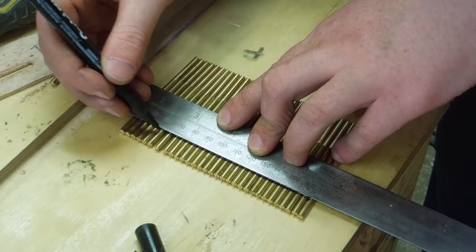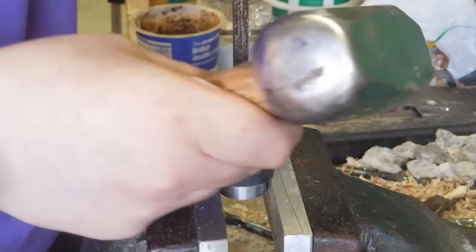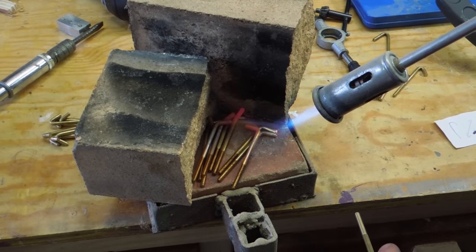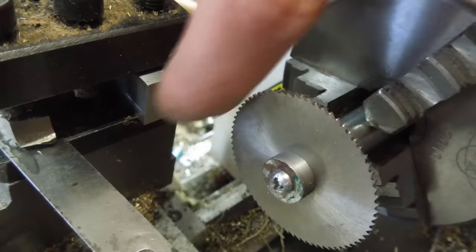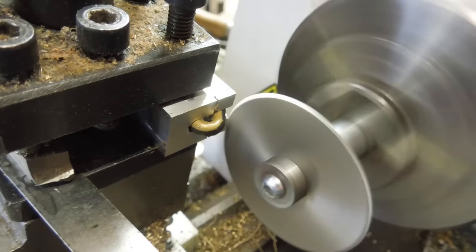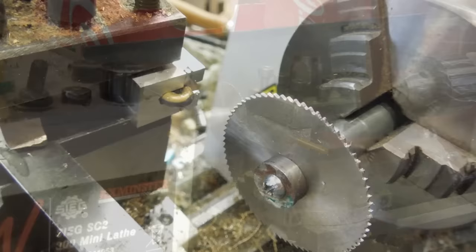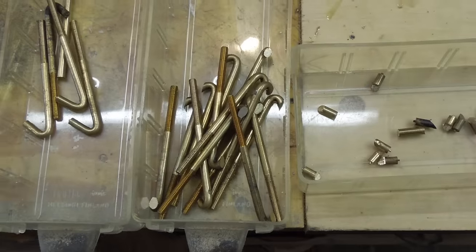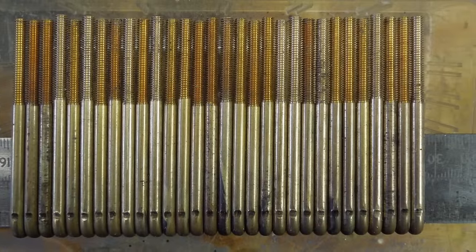They are all marked and then bent. Brass, especially CZ121, tends to work-harden and get brittle. To get around this they are annealed part way through the bending — heating the brass until it barely glows and then letting it cool. An aluminium fixture, just a block with a hole drilled in it and a bit filed out, is used with a slitting saw to trim the excess off. A few came out noticeably oversized; accuracy is determined mostly by the bending step, but it won't really be noticeable around the banjo rim.